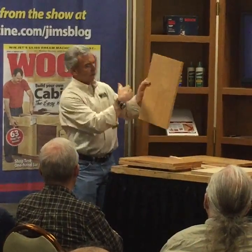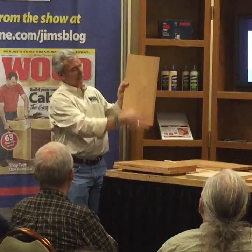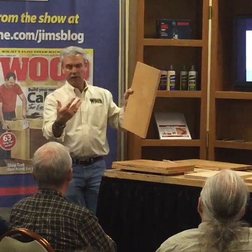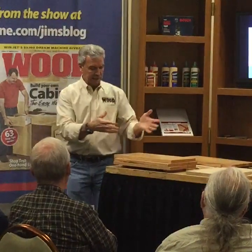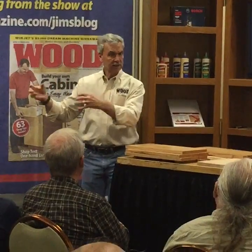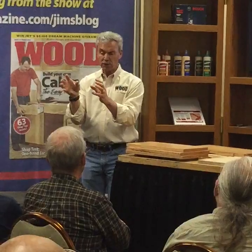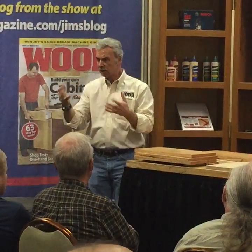When you look at a board across its face, you've got the center of the board, that pith part. You've got the outside edges here. There's early and late growth built into it. They're taking moisture in and giving it off always, regardless of the finish. And as they do that, on that wide board, it's somewhat irregular. The porosity is across the face of it. And because the board is taking off and taking in moisture a little bit unevenly, you get this slight little cup. That's the way it is.